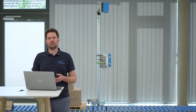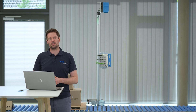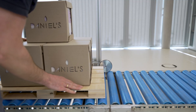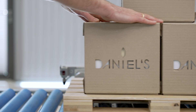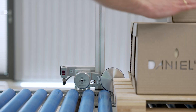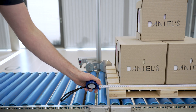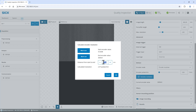Simply move an object a known distance and calculate the encoder resolution based on actual encoder values. Find a reference point close to the encoder — in my application, I choose the center of the encoder. I align the front of the pallet to the encoder reference point. Back in Signova, mark Start to save the current encoder value. Then move the pallet until its end aligns with the reference point again and click Mark End. Use a ruler to measure the move distance — in my case, the pallet length — and enter this value as distance from start to end. The encoder resolution is calculated automatically. Finally, I confirm with OK.